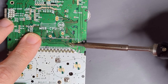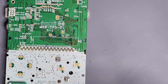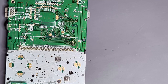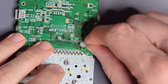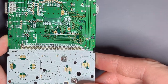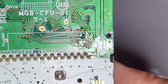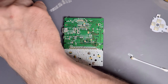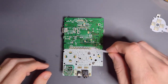This one down here is giving me a little bit of trouble, but otherwise not too bad. Let me clean that off and we'll see what's going on. With the flux cleaned off, you can see that there is solder in each of those vias. It doesn't need to be covering the entire ring — it might actually be impossible unless you were to scratch the vias with a knife to cover the entire thing. We just need enough for the solder to go through.